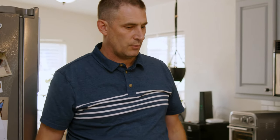On trailers, double wide or single wide trailers, the floor joists aren't usually as strong as in most construction jobs, but they'll usually have more bounce to them or flex. And so that's part of the reason why you might be having some issues, is that the tile might be cracking, right, from the flex of the floor. I don't know that for sure because I'm not looking at it, but I'm just speculating that that's a possibility.